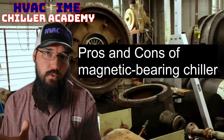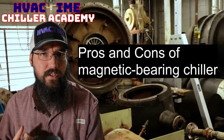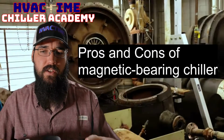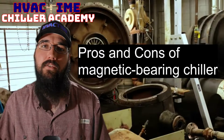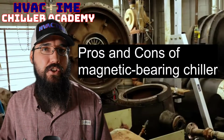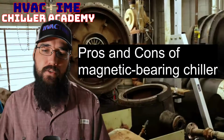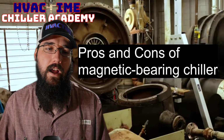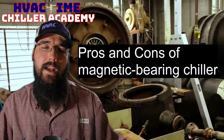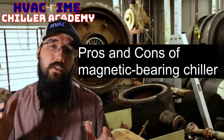Ultimately, though, pros and cons. So, the major pros to magnetic bearings, it comes down to really improved efficiency. I think that's the main thing: we can significantly improve our efficiency and simplify the mechanical design of these compressors, because most compressors we use in the industry are high speed. The way that we've had to achieve high speed in the past is through a geared system, right? Now, there are some modern motors that are DC based that are getting a high speed straight through the shaft, so those are a little different in modern terms, but for the most part, we had to use a bull and pinion gear to increase our speed on the drive shaft, on the output shaft for the impeller.